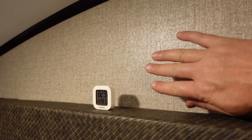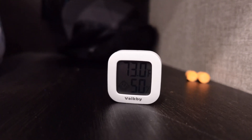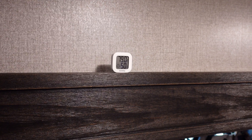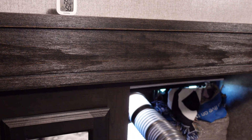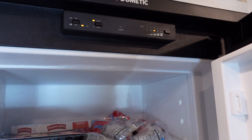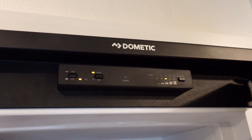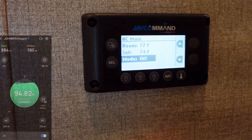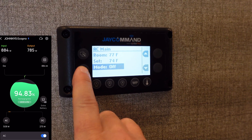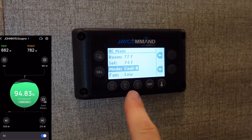I ended up using the Wave 2 during the evening — this is a new heater and AC unit from EcoFlow and it worked remarkably well because it's very efficient. The temperature near the sun-exposed wall was over 82 degrees, but down at head height it was only 73, which is a nice temperature. The other side of the wall was about 79 degrees but I was able to cool the front bedroom down into the 60s. I ran the refrigerator on AC during the day and just before bed switched it to gas, using the Wave 2 to keep cool at night.